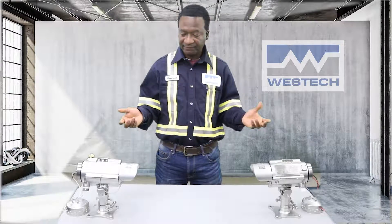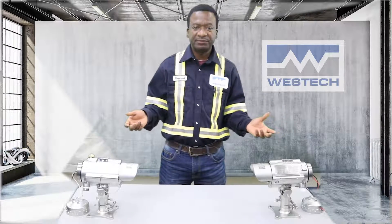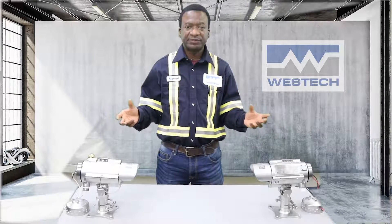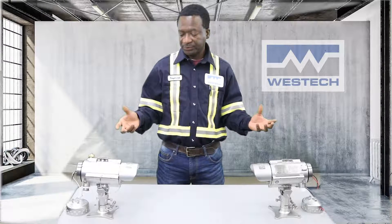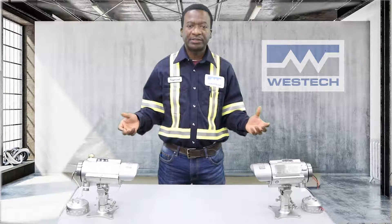The system is supplied as a four-wire system. This means that you have a positive voltage and a negative or common to power the system, and then you have two wires for your 4-20mA. The positive voltage and the negative voltage should be isolated from the 4-20mA wire system.